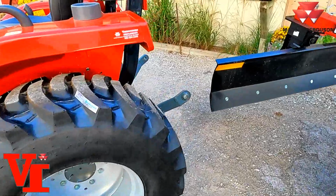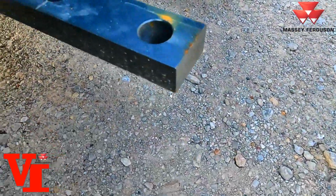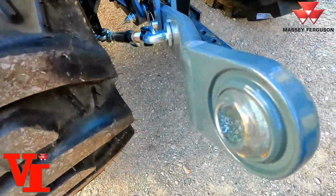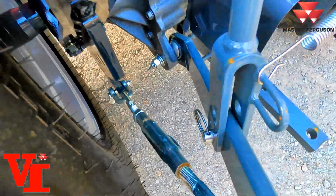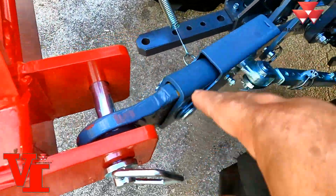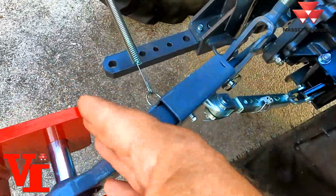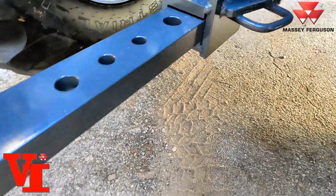When we're moving to the back end, one of the things is your drawbar. You're going to see your E series drawbar is going to have fixed link ends and the screw type stabilizers. When you come over here to the premium series, you're going to have telescopic link ends. We've got a 3-point implement hooked up here, but you've got the telescopic style link ends that you can adjust in and out. You've got a bigger, thicker, heavier drawbar.